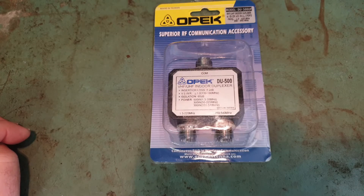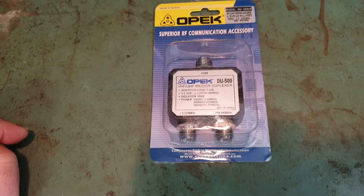I did pay for it with my own money. I'm going to do a little video today on what the SWR on my two separate VHF and UHF antennas looks like, then what it looks like if you just combine them with a T-piece, and what you get when you put it through the actual duplexer/diplexer. You'll then find out the reason why we don't just use T-pieces to connect two different antennas together. I'm going to get out the NanoVNA and let's have a look at these two antennas.